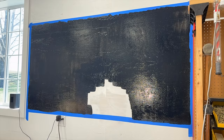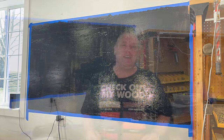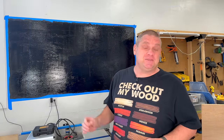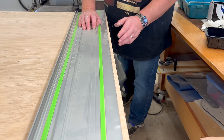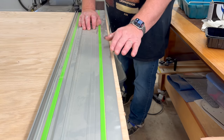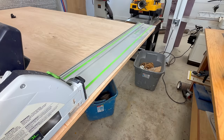Here you'll notice me going back to touch the area we just painted in white — I was impatient and wanted to make sure that white paint was dry. While we let the first coat of black paint dry, let's talk about how we're going to make those cleats. We need to grab some plywood — in this case, a three-quarter inch sheet of oak plywood. It's a bit unmanageable, so the first thing is to cut it down to 80 inches. First I want to clean up one factory edge with the track saw, using a rail square to make sure we're perfectly square.